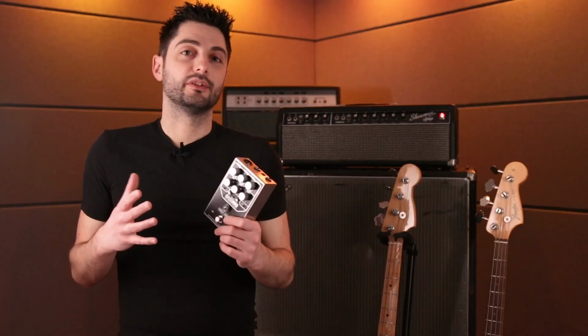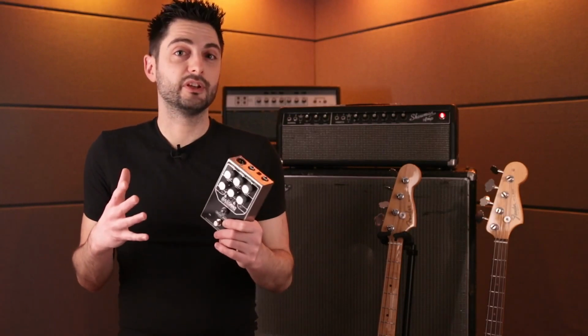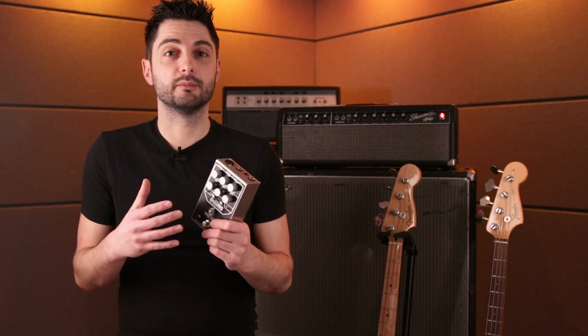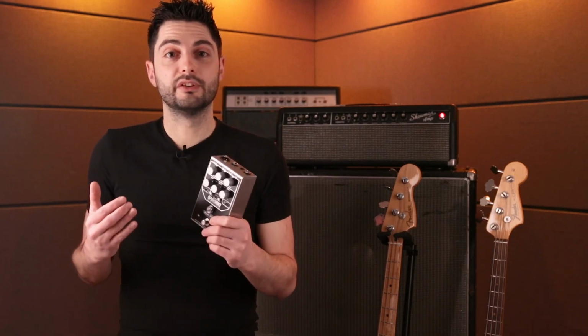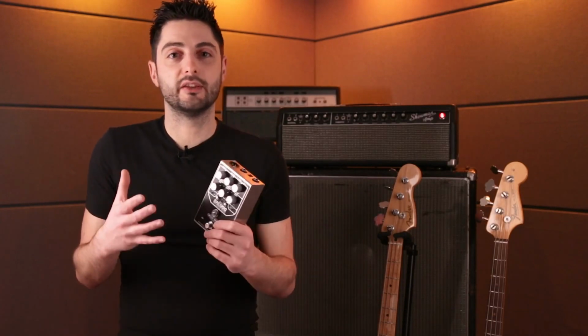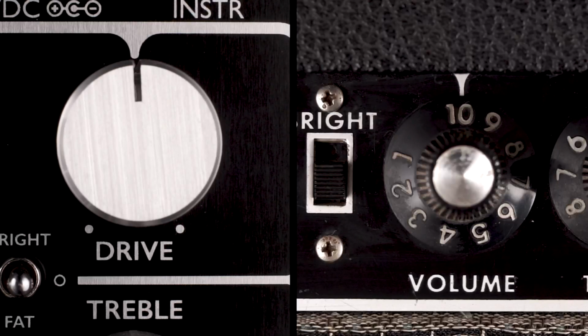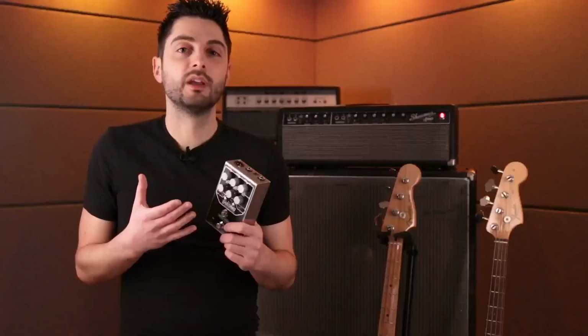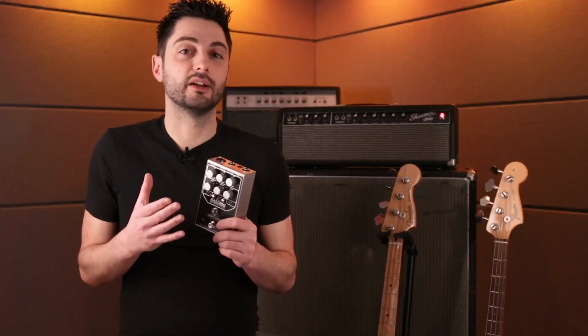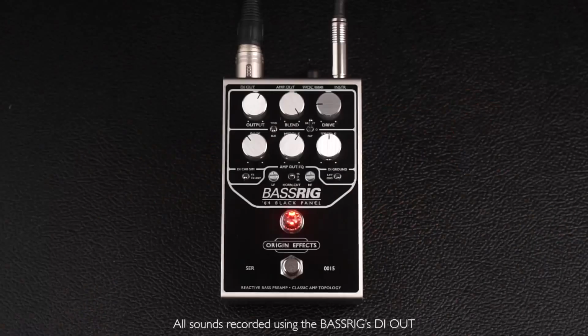We put in a lot of effort to cover a range of high-powered Fender bass amps, replicating an entire valve amp signal path in miniature using all solid-state components. Just like a real vintage amp, the preamp, tone stack and push-pull output stage all interact together to give you the perfect 60s bass tone. With a drive control that works just like the volume control on a non-master volume amp, you have access to a range of warm, clean tones and gritty overdrives. Despite Fender's reputation for cleaner sounds, the 64 Black Panel is capable of some pretty awesome distortion.